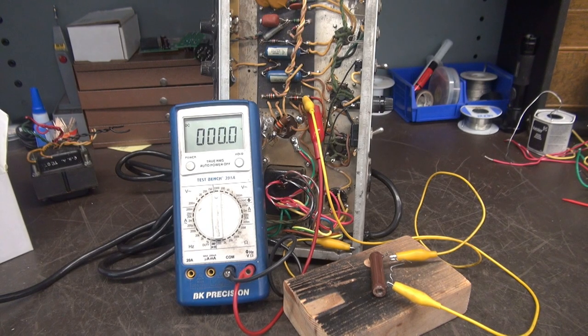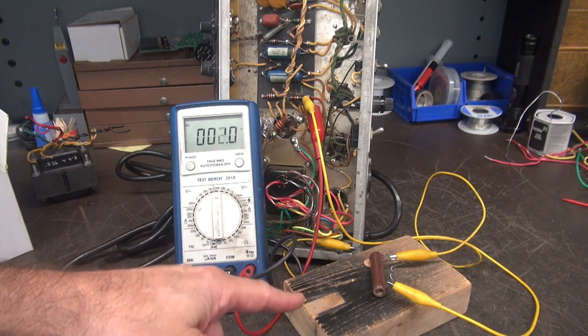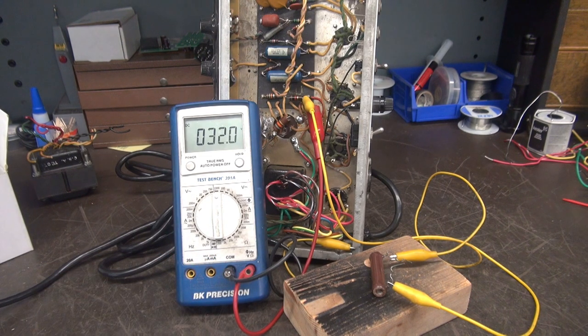I got the power supply wired up. Now we're going to do an initial test to make sure the high voltage is working. I only have the 5U4 rectifier tube in at this time — no output tubes installed. I'm using a 25k resistor as a load for the high voltage so that it discharges between testing and I don't get blasted. I'm bringing it up on the variac — at 50 volts input right now. See our high voltage coming up — taking it right on up to 100. There is the new high voltage on the Princeton. That's working.